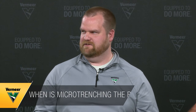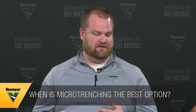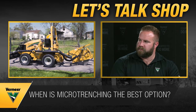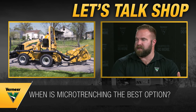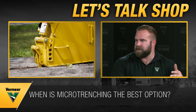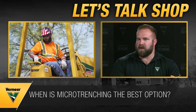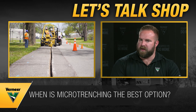We're seeing a resurgence of micro trenching as underground right-of-ways in cities get really crowded. Micro trenching is an ideal option when the cut needs to be narrow and relatively shallow — staying above pre-existing utilities. It excels when the majority of material being cut is asphalt-based and performs well in small, tighter-radius installations. Challenges arise with longer-distance applications or wider cuts, though Vermeer is working on options to address that.